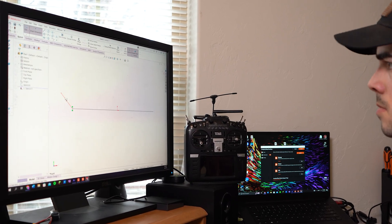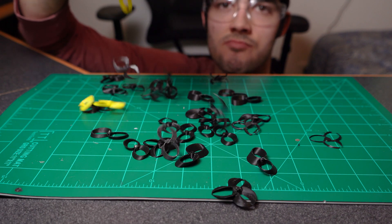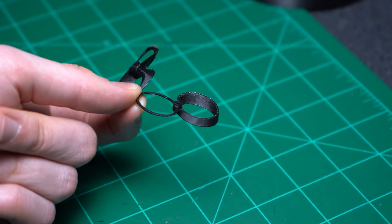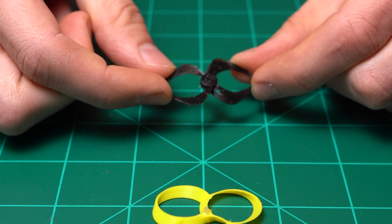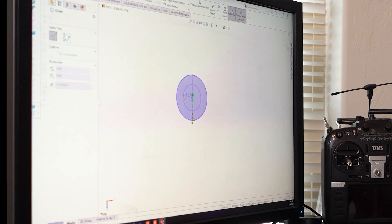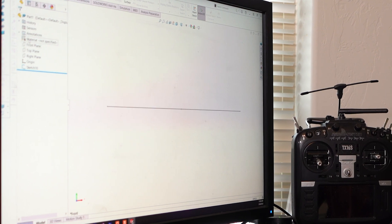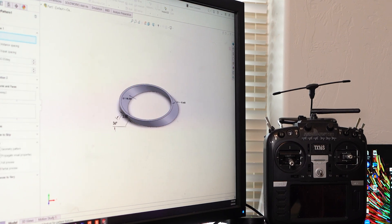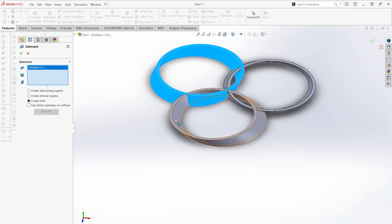The design process was far from a first-try success. I went through a lot of renditions — over eight different designs in total. Some were two-bladed designs, which are more common, and that's where I found my first success. I then tried making the props with a traditional airfoil shape, which ended up being a total nightmare to 3D print. So I scrapped that and went back to 'keep it simple stupid' — making the walls the same thickness throughout and not varying the arch of the blade, which made for much smoother printing and better performance. I then reapplied that concept to a three-bladed design, which ended up having the best performance overall — which still wasn't great, but hey.